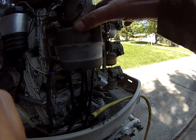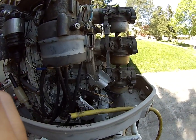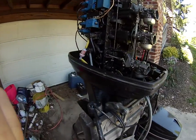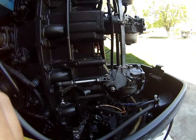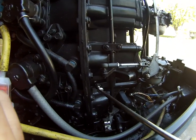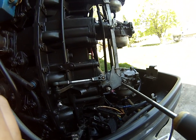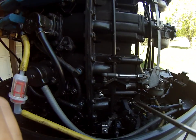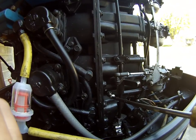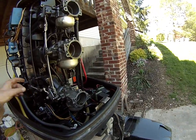Now I'll go over to the five cylinder engine, where you can see this particular cam has two scribed lines. This engine has been set up for idle speed, and you can see where the scribed lines are below tangent with the roller. You can also clearly see the tower shaft and the idle stop screw on this particular engine.